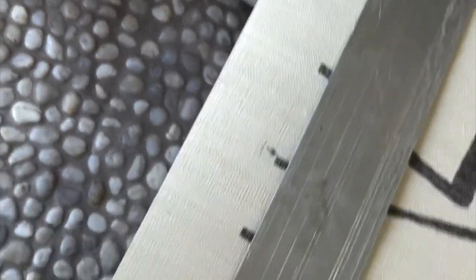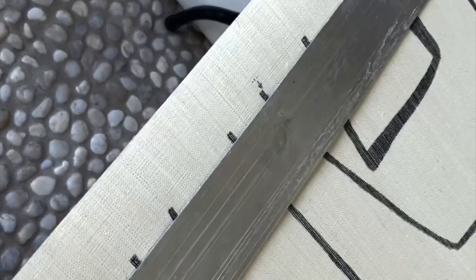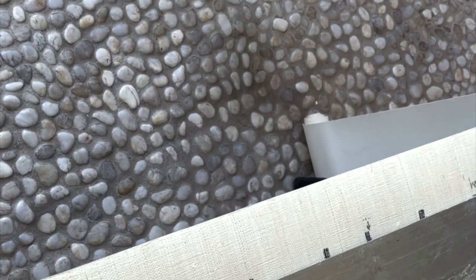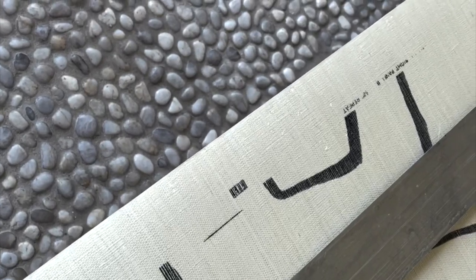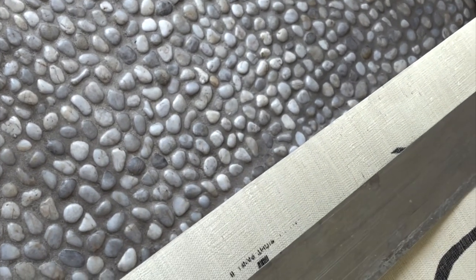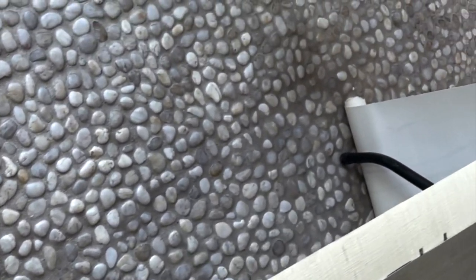I'm still going to make some lines, because you and I both know this stuff moves. We want to make sure that we're on the line. So with my pencil, I've made one point here, another here, and another here. Because when you start trimming this, things move, and you wind up with a crooked piece of wallpaper. It happened to a colleague friend of mine up in Ontario, Canada. He called me and said what do I do? The advice I gave him was to hang it crooked, because the pattern would not reveal the lack of plumb in the pattern. But this will. So we can't make that mistake here.